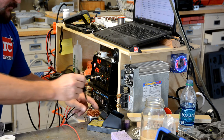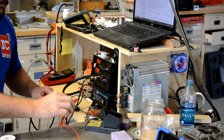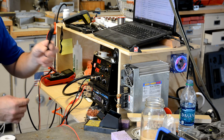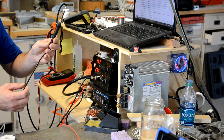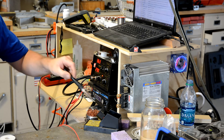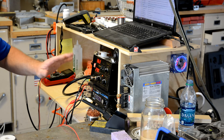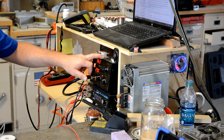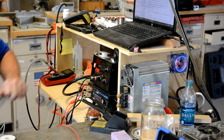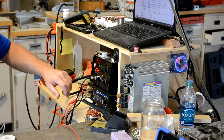These are good for cleaning the tips — after your tip sits overnight you can get all the corrosion off, then sponge it off. The one thing I'm not tickled about is the wire: it's 24 gauge but it's not silicone wire, so don't touch your soldering tip to it or it'll make a mess. It's a quiet, affordable little machine because it has a great soldering system plus the heat gun built in. The heat gun will keep going until it cools off so you don't burn out the ceramic element.